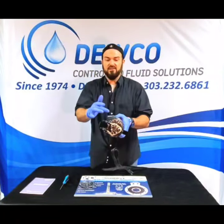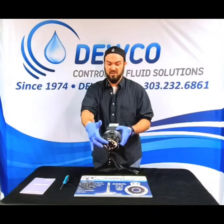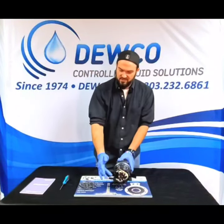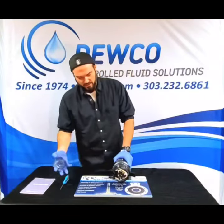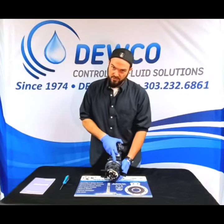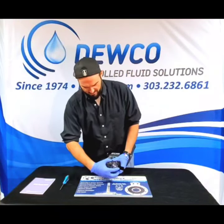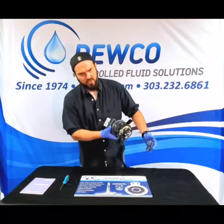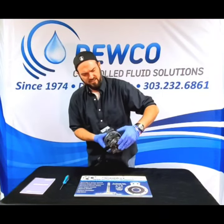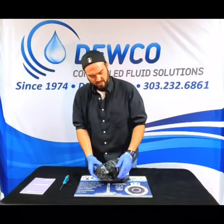Now all we have to do is put the housing cover back on. The head itself spins and the speed dial area also comes off — every piece of this comes apart, very easy to repair. Slide that back into place. The arrow right here — you always want this arrow to be on the exact center of the drive. The easiest way is to start with the two areas that go around the pump tube on the top, slide those in first, and then reattach the clasps on either side of the pump head.